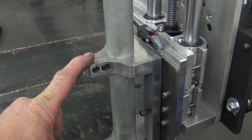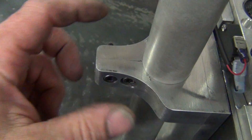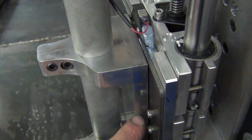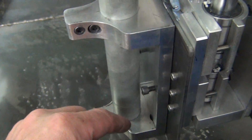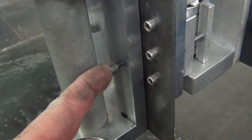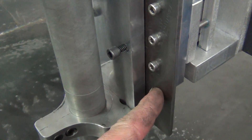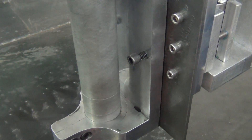I had some three-quarter inch 6061 aluminum sitting in the shop. I cut this out to a profile and brought it down so I could get some flexibility in here, drilled and tapped quarter-inch-20 holes. Then I got some half-inch aluminum, drilled from behind, countersunk. Quarter-inch-20 locating studs go through to the other side with little holes drilled here just to locate the torch holder to the carrier, so I don't have to play around getting it plumb and level every time it pops off.